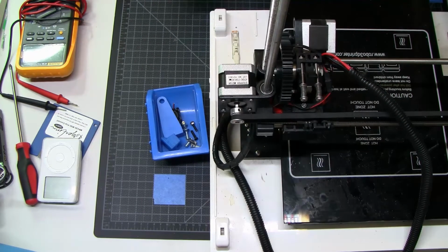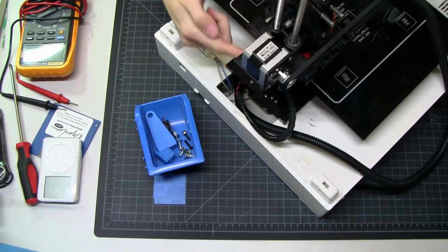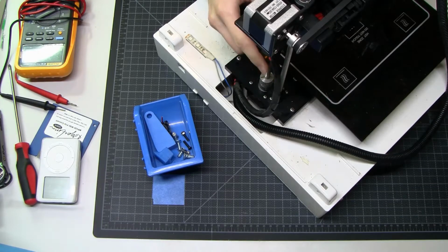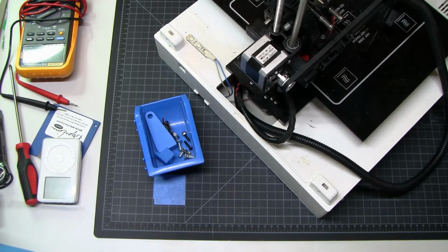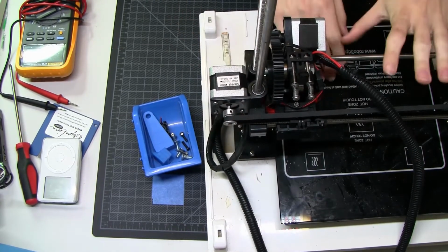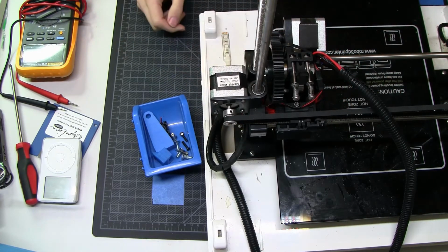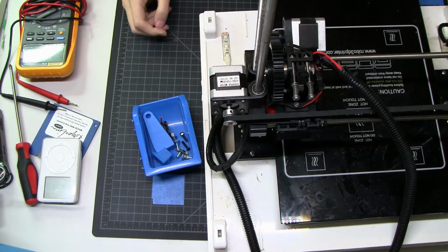And there are two limit switches, one on either side, that lie under the device that had swiveled out, so they were just floating in here. It turns out those actually do just sit right in here. They calibrate Z by actually touching the print head down on the bed, and when they sense that the whole gantry is pushed up off of its Z steppers, they trip, and that's how it zeroes Z, which is concerning as a design. I don't know why that was the choice, but yeah.